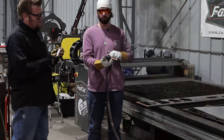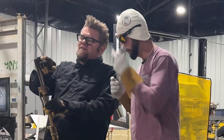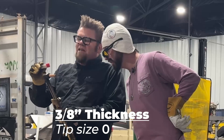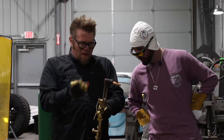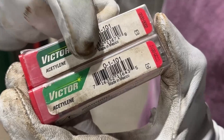Number two: that's three-eighths plate, and that's not even the right tip — that's a propane tip. You can tell because propane tips are two pieces. For three-eighths plate, you need a single-aught tip — that's a one-zero on the card. And if you were to go thicker, a single-one tip is going to be for something like three-quarters inch.